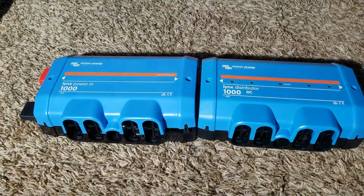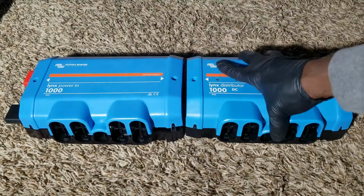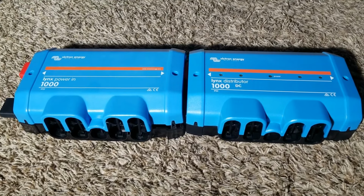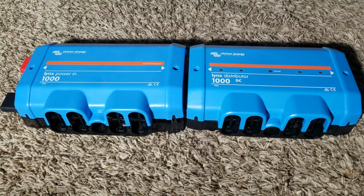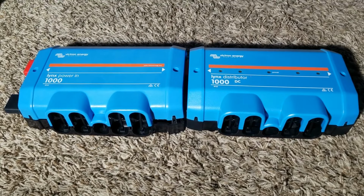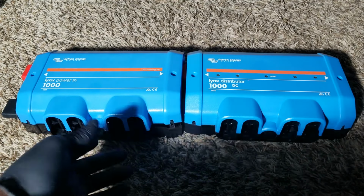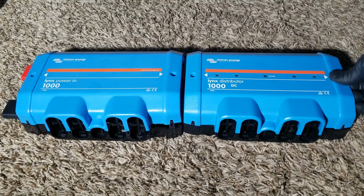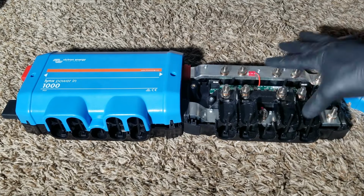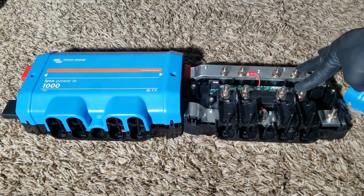Look at it. Beautiful. You can have multiple of these, like I've mentioned, and you will see how efficient, how productive, and how clean built, more professional your system is going to stand out, and gives you robust power or efficiency when you drive in power. You can do maybe 2 or 3 of these. If you have a lot of strings of batteries, you can tie them here, and this one is going to tie to your equipment. You have to fuse them here. If you want to put a fuse here, that's fine, and you drive all the equipment here. Maybe a charge controller, an inverter, whatever you want to do.